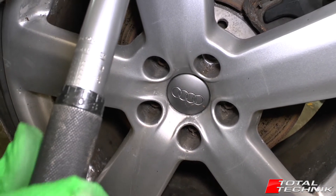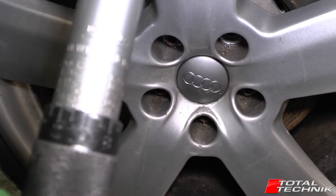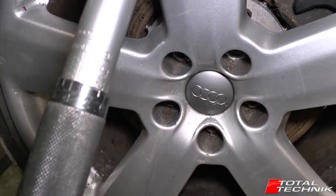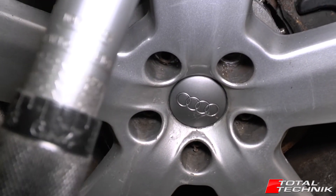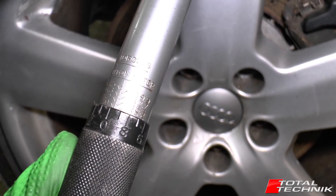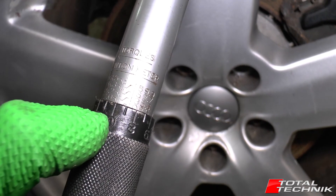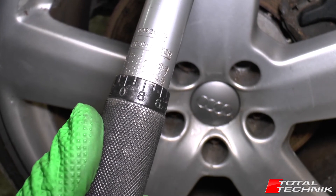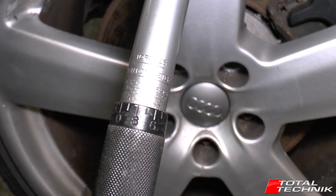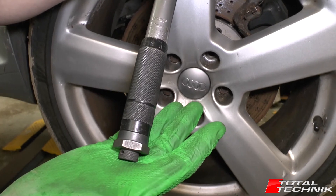What I'm going to do is bring this handle up so that the bottom of the handle is in line with the 122 mark — like that. There's my 122. Now all these markers will end exactly on zero. That's 122, but I want 120, so I'm going to roll back by two. I've moved the handle back so that will be exactly 120. Then I'll tighten up the bottom of the handle as we discussed, and the torque wrench is ready to use.